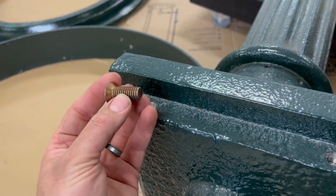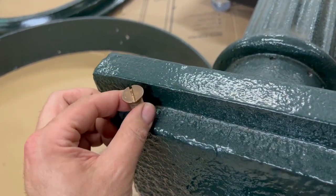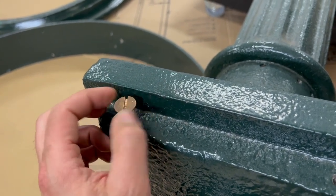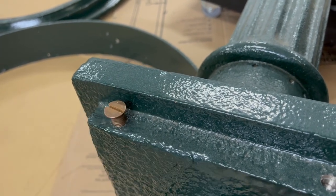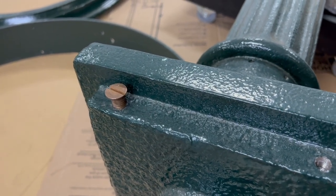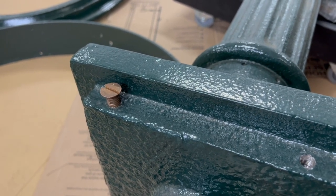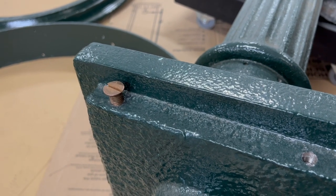This metal is an interesting color — this is a silicon bronze fastener. The advantage of silicon bronze is it is highly corrosion resistant. Stainless steel is called 'stainless,' which does not equal non-staining; there is still some corrosion in some stainless steels. But the problem with stainless steel is it galls very easily — it sticks to other metals with any amount of friction.